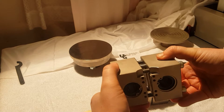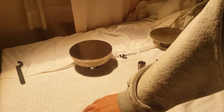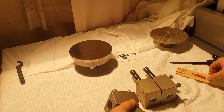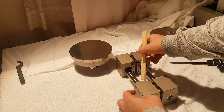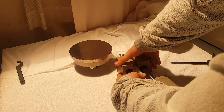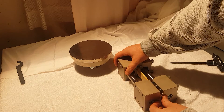Now that I've loosened the screws, it can widen out. You'll see the serrated inserts there to grab onto the sample. Starting with the top — it's usually a little easier to do when the fixture is lying down. Open up the bottom. It's important that the sample is parallel and also that the sample is flush with the bottom and top of the fixture.